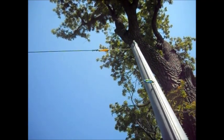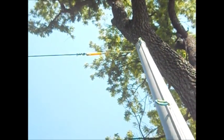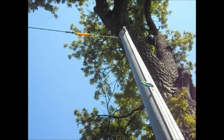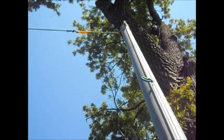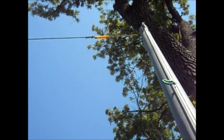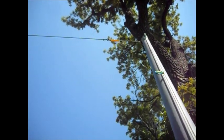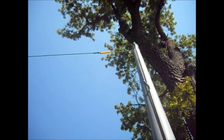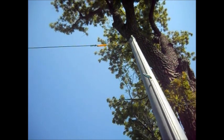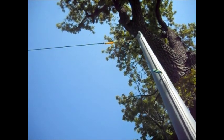Okay YouTube, this is the second part. We'll try to zoom on top of the stepladder. We used the flagpole rope to hoist that up. We made a ring out of the white piece of electrical wire, and without any tension on it — just laying on the ground — we hoisted it up there. We had to use the garden hoe to kind of scoop it up there, a piece of plastic just off an old brush handle. I didn't want to use bare wire on the flagpole — we want to insulate that away from the ground as much as possible. Here's the actual antenna wire. I just wrapped the wire around itself — that stuff's pretty strong, once you wrap it with steel wire it's tight. But you could put tape on it.